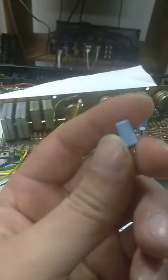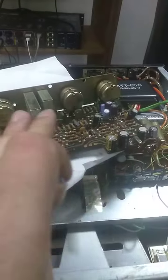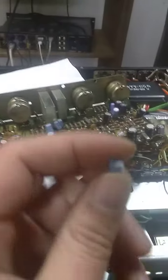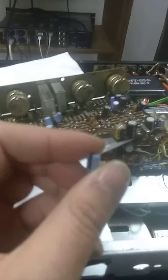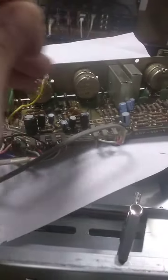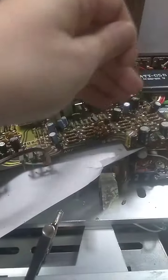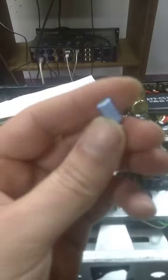You know you're getting a good receiver when I sell this one, because it's going to have basically the preamp section nearly completely rebuilt. It's going to have as many capacitors changed as I have available. All these are changed out already, and I have a few over here already changed out, because I was just chasing this problem all through the circuit — and it came down to one capacitor that does test good.